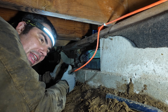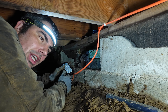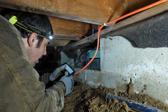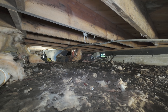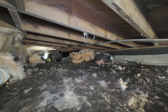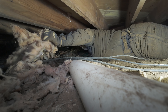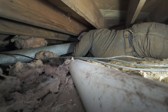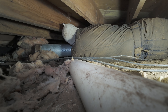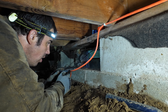What we're going to do to remediate some of that moisture intrusion or humidity is increase airflow — that's how we do it. The first step of that process was taking out all of the old unused ductwork and insulation. We're in the hot humid south; we do not insulate our crawl spaces. If someone sells you insulation for the crawl space, they took your money, because it's never going to pay back — in fact it's going to cause problems, holding and trapping humidity and moisture.